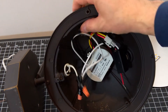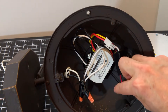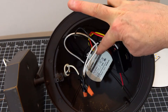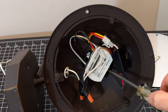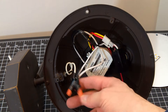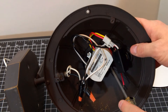Here's a close-up of the conductors. The photo sensor or photocell is to the right and has already been disconnected. I have a timer that runs the lights on and off, so I don't need a photo sensor. The constant current driver is in the middle. There are two screws that hold the driver in place. Then there are the wire nuts for the main and the neutral.